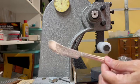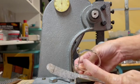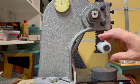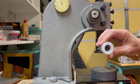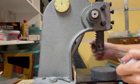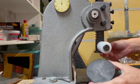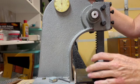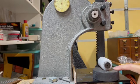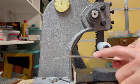We'll do the curl last, because if we do it now it's going to get smashed. If you're using the bender press, I have it on the smallest nylon roller, and it's actually on the very biggest peg because it gives me more reach. I'm using the rubber hockey puck — it gives me more room to get this over to the center of the rubber puck. We're going to do the bend on the back side.